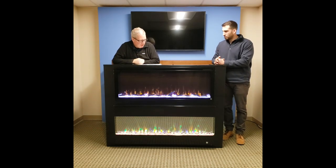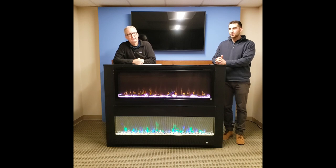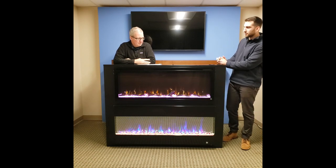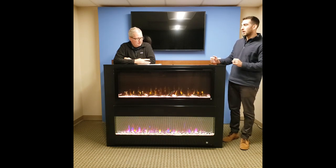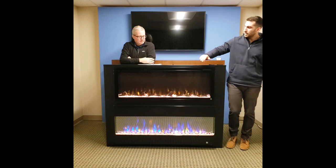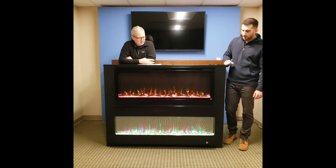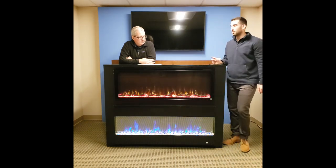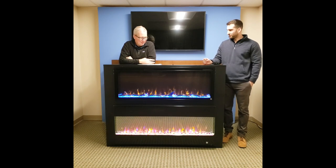Question: Can the TV be mounted safely above a fireplace? Yes — this is probably one of the main questions we answer. With an electric fireplace, the heating source is basically a heating coil with forced air, not extreme heat. For wall-mounted fireplaces like the Onyx, we recommend at least 24 inches of space. With the Elite series, where heat comes from the front, you only need eight inches from the bottom of the TV to the top of the fireplace — and even less with the Fury, which has that extra frame buffer. Mounting a TV above is definitely safe and something a lot of customers do.